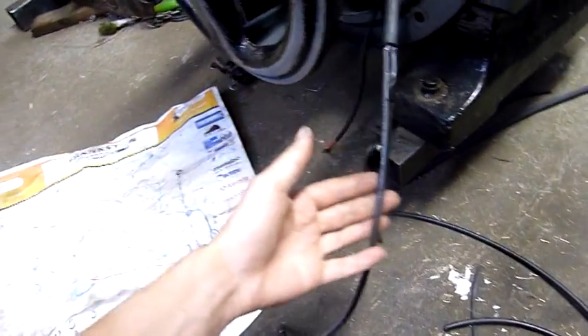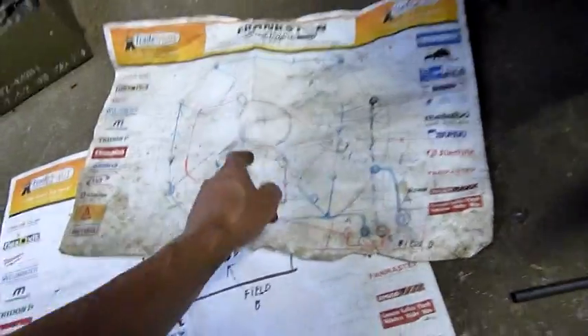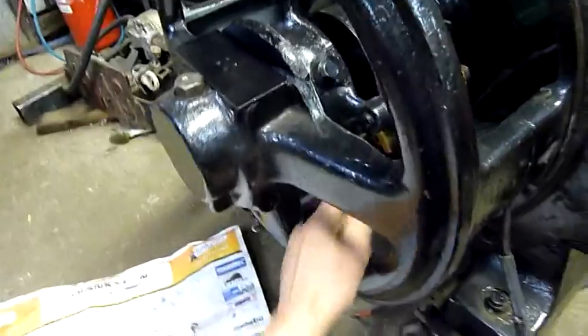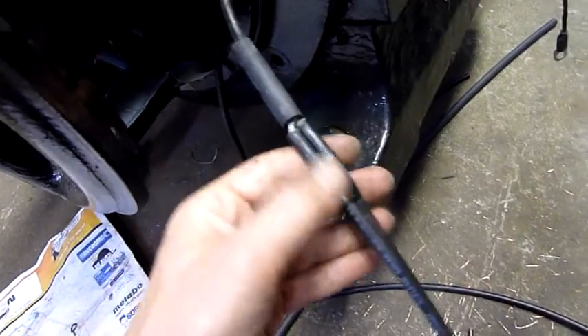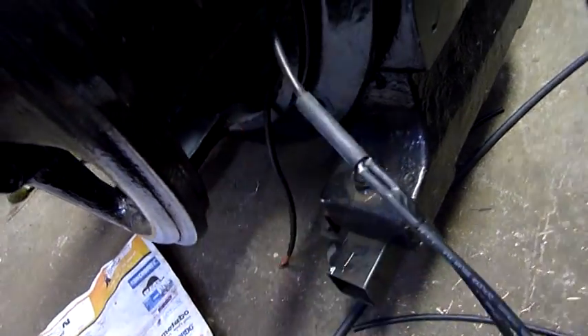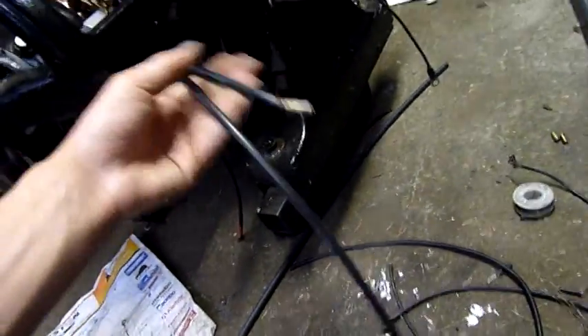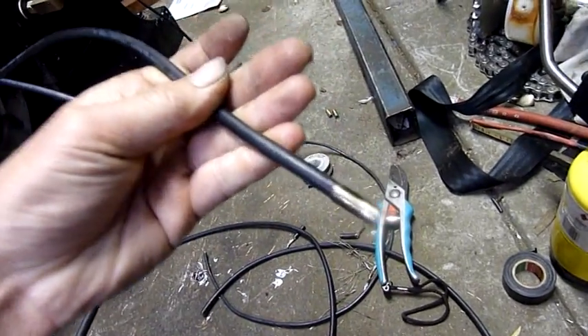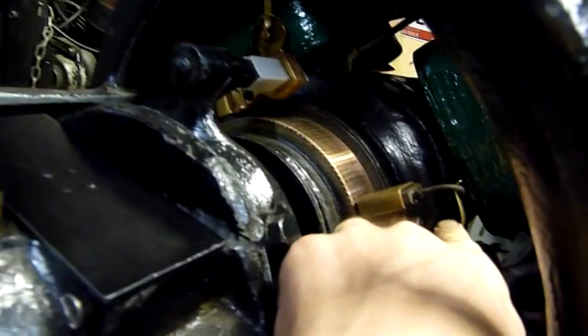This is the brush cables for brushes C and A — that's A up there and that's C down there. I've got a copper sleeve: crimp the wires into a copper sleeve, and I'm just heat shrinking and lagging it in electrical tape. That'll do that one. Likewise for brushes B and D, I'll do the same thing — terminate it with a copper sleeve and just heat shrink and lag everything together. The brass bushings are just going to the brush holders. That's an original item. They go in there and you just tighten the screw down, get the brush out of the way, and you can tighten that screw down and clamp the wire into it. It's a nice modular little system, very easy to service.